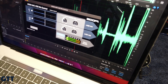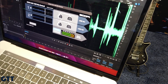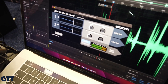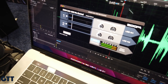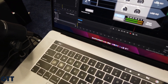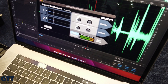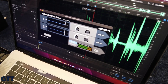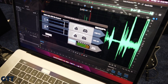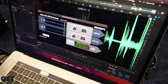If you're using streaming software and you weren't in streaming mode, you would get input one in the left and input two in the right. In streaming mode, everything goes to both channels. Streaming mode is what most of us would use for voiceover since we're doing mostly mono. The loopback lets you play back a take and have it sent back out on the USB. The purpose of loopback is primarily for when you're doing a stream and you have audio from a DAW, a YouTube video, or any other sound source on your computer that you want to mix in with your microphones and send to the stream or recording software together.